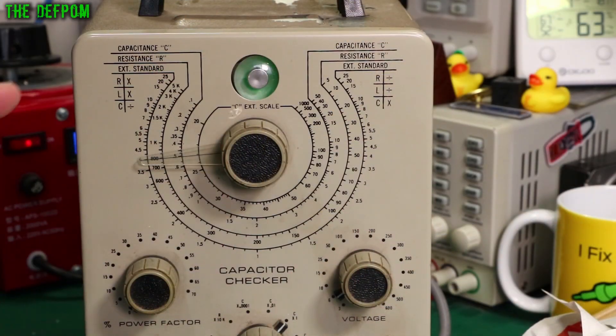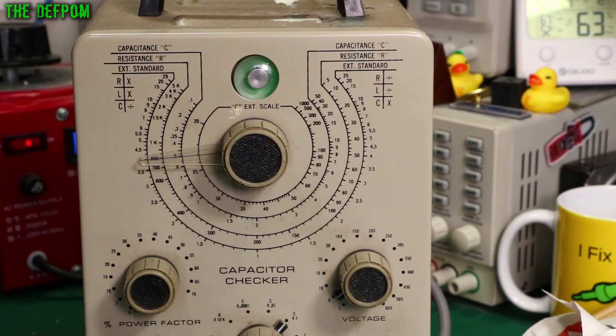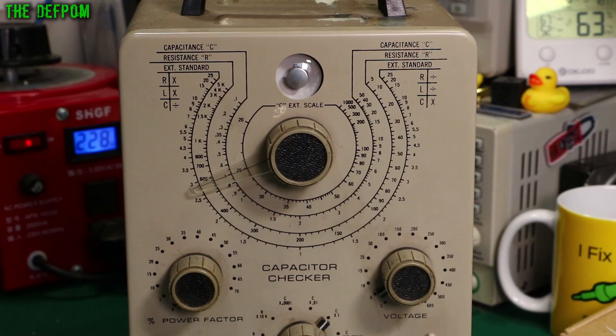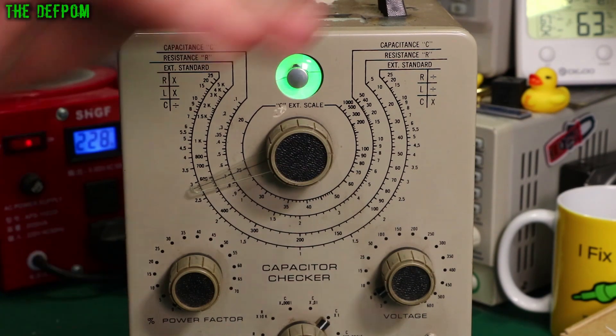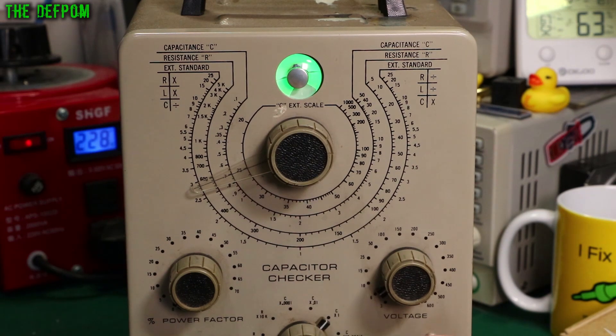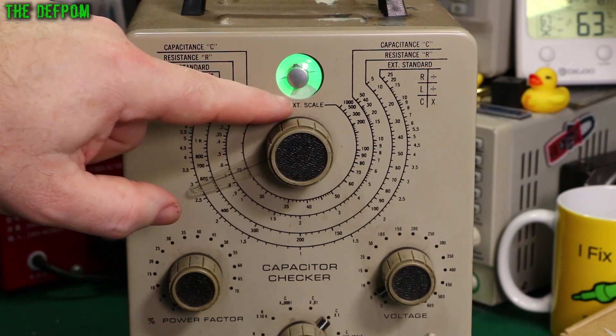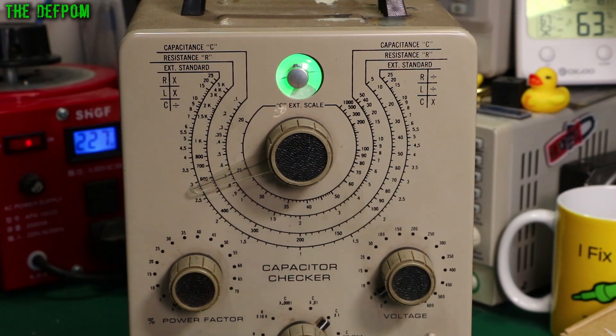The old tube has warmed up — you can just see a faint green glow, almost invisible with the lights on. New tube is now installed. Let's see if it's much brighter. There we go — oh, look at that! That's much better — a huge difference. That's how it's supposed to be. Excellent. If I change it to discharge mode, there's the magic eye. I need to rotate it a little to get the lines horizontal, but it works. Happy with that.